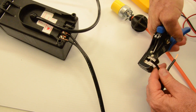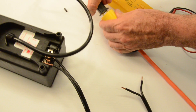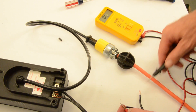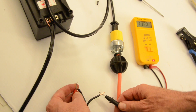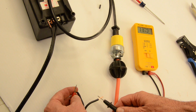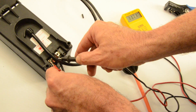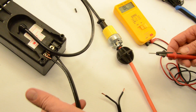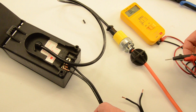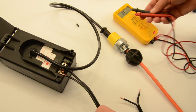I stripped off this wire — this is the end of the wire, 150 feet away from the transformer. I plugged the transformer back in to find out: on a 14-gauge wire at 150 feet away, what voltage do we really have? The reading is 11.72 volts at 150 feet away. Back at the transformer it is exactly the same. So with 150 feet of 14-gauge wire running across your yard and no light fixtures on it, we're not losing any voltage at all. As we add light fixtures, we'll check the voltage and see where we're really at.